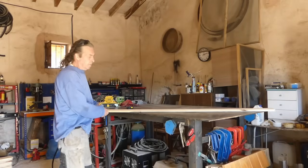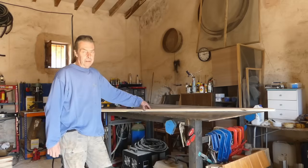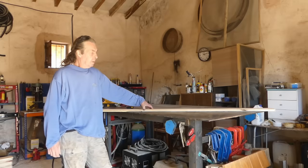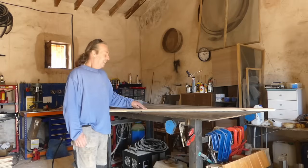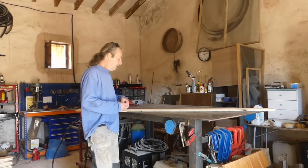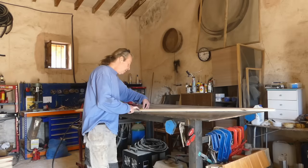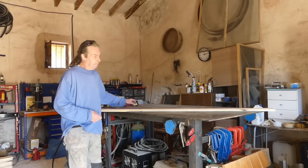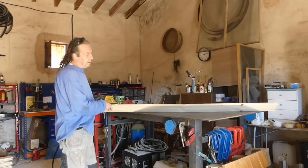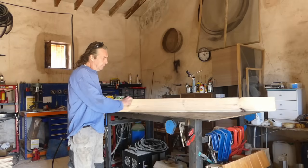So this is the timber I'm going to be using. It's tongue and groove, maritime pine. The width for the doors I want is 650 millimeters, which are both identical, which is always part of the plan. We made it like that. I've got a slight hitch possibly here. The width of the boards is 125-ish millimeters. 130 would give me exactly 5 boards per door, but I'm going to need to take the groove off. This is tongue and groove wood, by the way, which will make the outside ones slightly smaller.